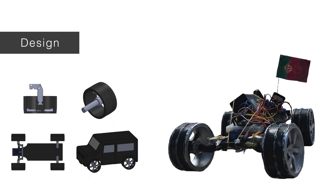Front wheels differ from the back wheels in the sense that the latter don't have their axis of rotation embedded. This led to the arousal of a joint, which became a tricky part of the project. In spite of designing these two regions to be complementary so that one could rotate inside the other, this wasn't perfectly achieved after printing. We corrected this issue by adding one metal crown to each wheel.